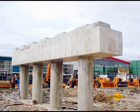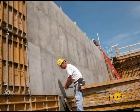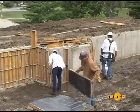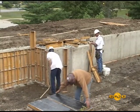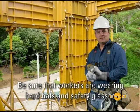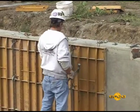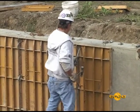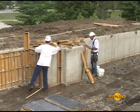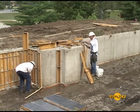In order to secure low stripping cost and at the same time protect the form equipment, the crew performing this operation should be properly instructed and supervised. Systematic handling of each operation will save both time and equipment. Be sure that workers are wearing hard hats and safety glasses. Stripping crews should be provided with buckets to collect and sort accessories directly as they come off the wall. This practice will provide an efficient operation and greatly reduce the possibility of accessory losses on the job site.